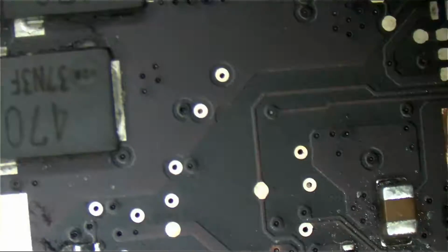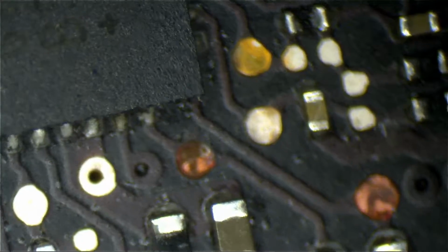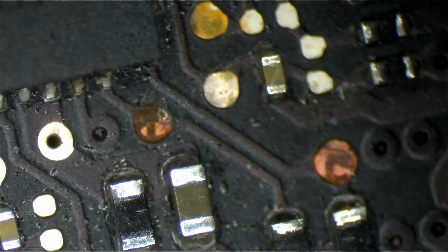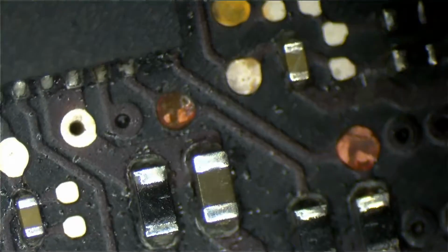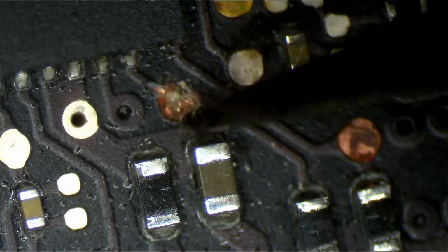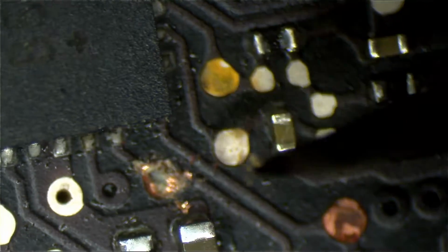And again, this is a quickie video, so if you want the full explanation of everything, you can look at the CPU IMVP_ton video that I did a long time ago. Basically, this buck converter IC is meant to take 12 volts and turn it into 1 volt or around there for the CPU. This can be used in many different machines: ones that have a 12-volt power supply, an 8-volt power supply, a 14-volt power supply. But how does it know the speed to set the switching? It's going to tell that from a resistor going from the high side power supply to the chip. And unfortunately here, they're broken.